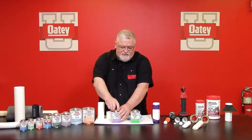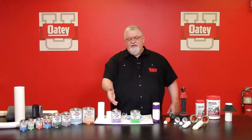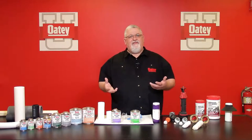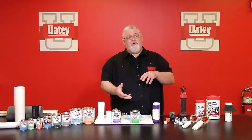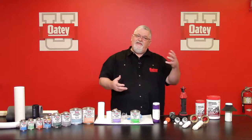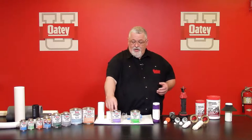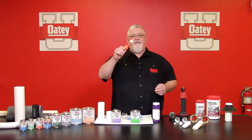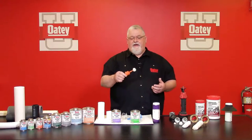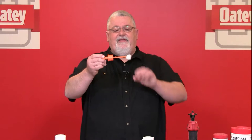In the field, you'll find that the lid on the can is often left off to the side, which means you're evaporating the solvents inside the product. In a solvent cement application, the solids — which we refer to as resins — remain, and as the solvents evaporate the formula starts to get thicker. We always recommend keeping the lid at least covering the hole. We also offer an adjustable dauber that fits into the mouth of the can, so as you get less cement you can pull it out and reach everything down to the bottom.